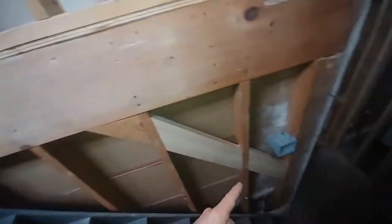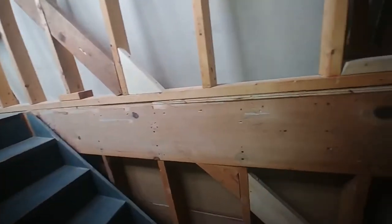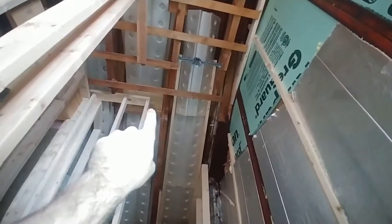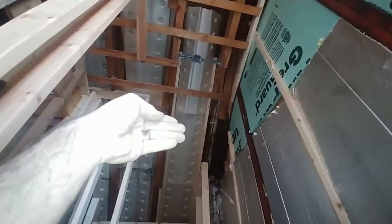Fix up this blocking for the railing system. May want a blocking next to the toilet for the toilet paper. And then I just cheated. I established where the plane of the roof will change. It'll go through to the far side of this wall right here, and then I put black marks up there. Since that'll be where it tips and comes down at a new angle, I sistered onto the sides of these two and brought the ends of them down to what this laser line says.